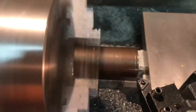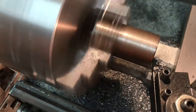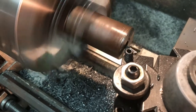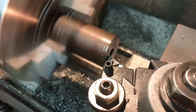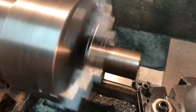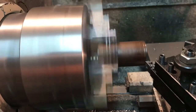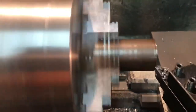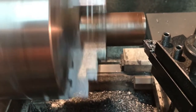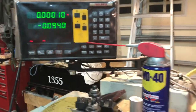It's always nice to take a facing cut like this because you can set your DRO to zero. Come in a little bit from the center and then bring it back out — you get the smoothest finish cutting from the center outward. All faced off, looking good. I'm going to hit zero on my Z and come around to the body. I bring it up, I can see it picking up the oil — I'm not actually cutting the steel yet but I know I'm really close. I can feel a tiny bit of resistance, so I'll zero my X.